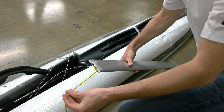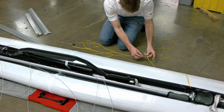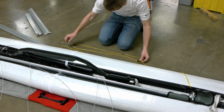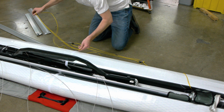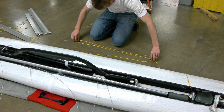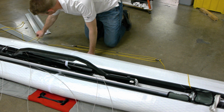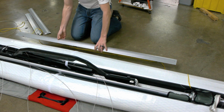Gently remove the broken down tube parts away from the glider and remove the VG system completely. If you have the 2-to-1 VG system, such as on an earlier T2 or Sport 2 or U2, the lower VG cord simply runs up from its attachment in the bottom plug, around the pulley, and back down through the down tube. Feed the VG system into the new down tube from the top, taking care that the VG ropes are properly oriented and not twisted.